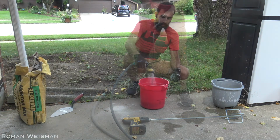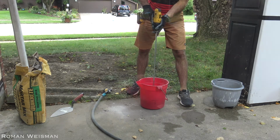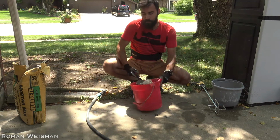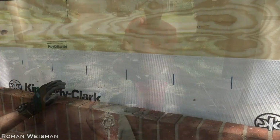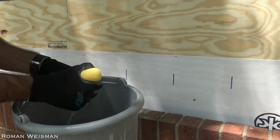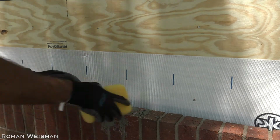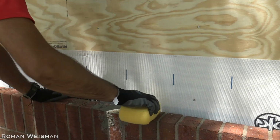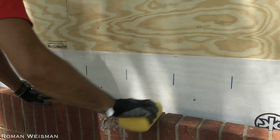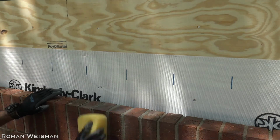Another way the water penetrated was through holes in the mortar between the bricks. I solved it by applying new mortar. Unfortunately, the approach I chose burned my hands. One of the fingers looked like a third-degree burn. This happened since I constantly soaked my hands in the same bucket having water and mortar. I tried changing the water when it got gray, but apparently it wasn't enough and was too late. The chemical reaction continued. Another problem with this approach is huge waste of material.